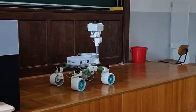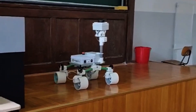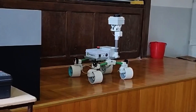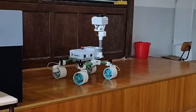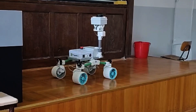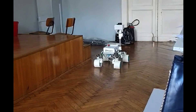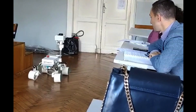The rover is still a work in progress but I managed to conduct some tests. Here you can see the rover turning its wheels first to zero then to 180 degrees, which means the rover can actually move from side to side freely. This was from when I was defending my bachelor's degree project. For the final test I drove the rover a bit. You can see the slop in the mechanism when the rover starts and stops — that's the M8 threaded rod issue I mentioned that I plan on fixing in the next version.